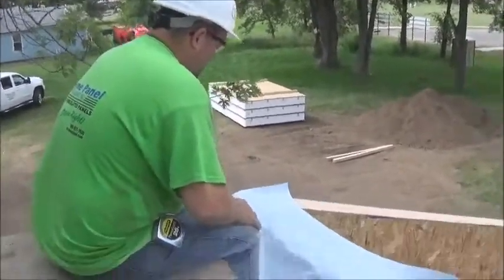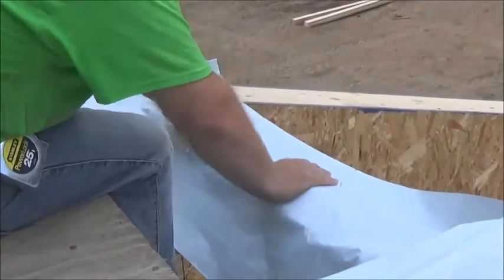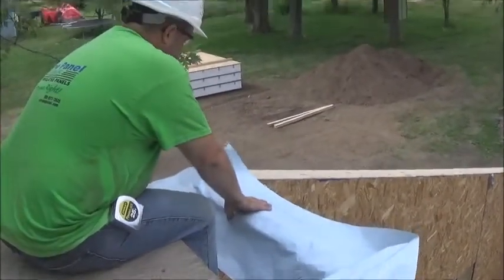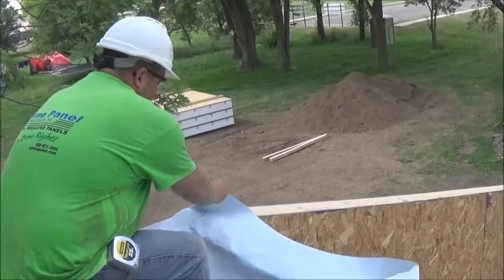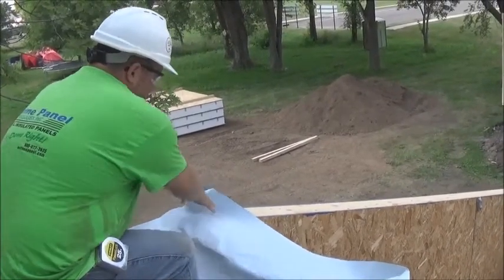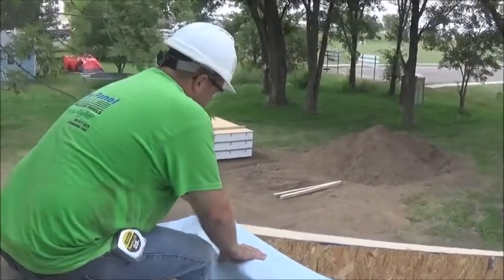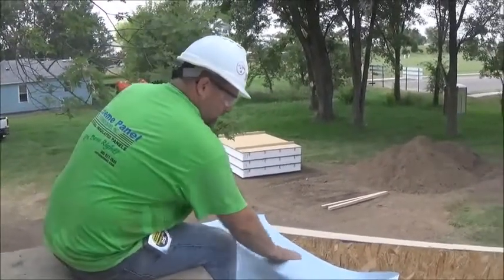You can see I've got it down here — here's my beam. I have a wedge right here at the center, so basically center it on that ridge beam. We don't have a hammer tacker right here, so we just put a couple screws in the end for now. You'll notice there's this two-inch or two-and-a-half inch strip you can peel off on this edge — we are not going to do that until we have the roof panel set. That's the only part we peel off; this area always stays up.